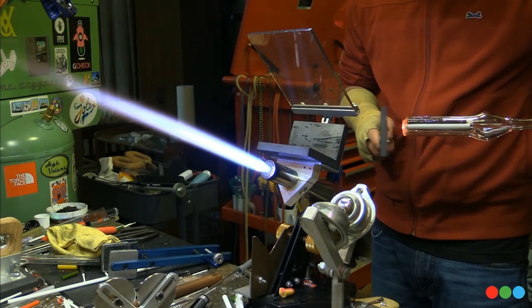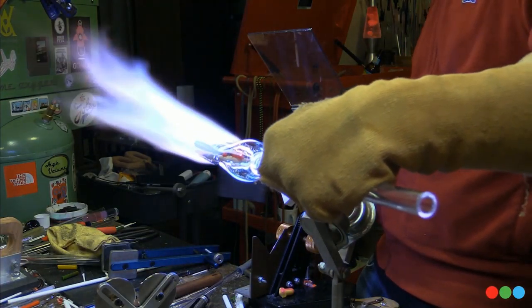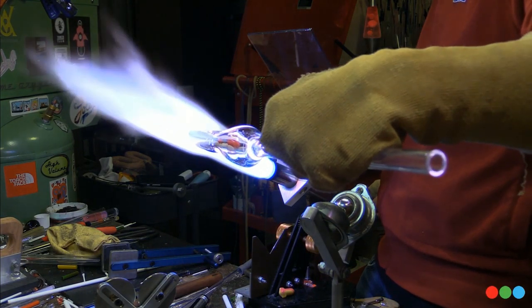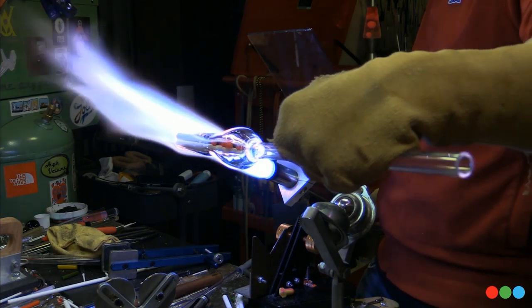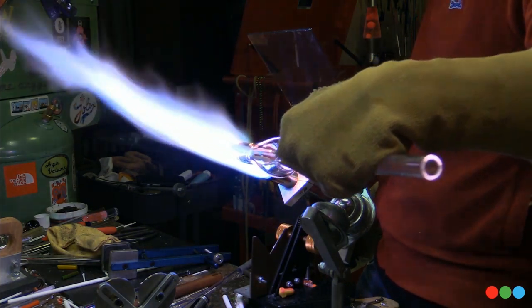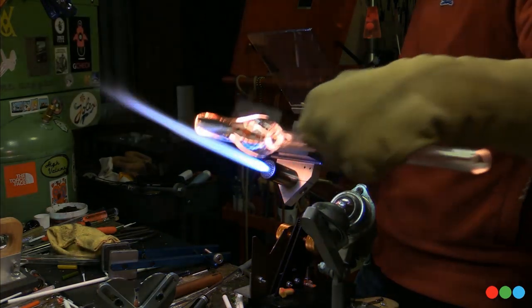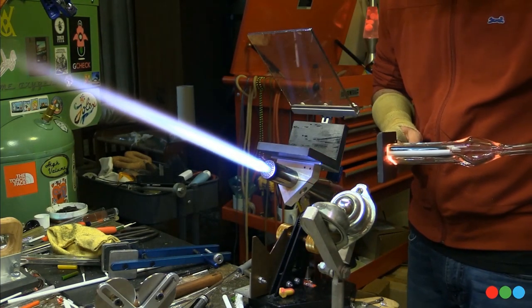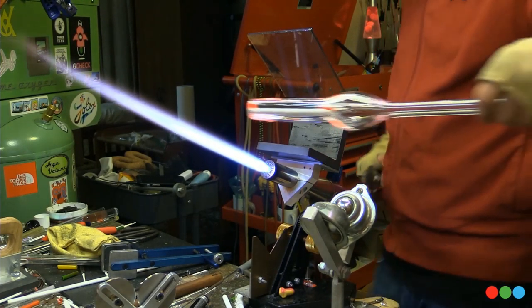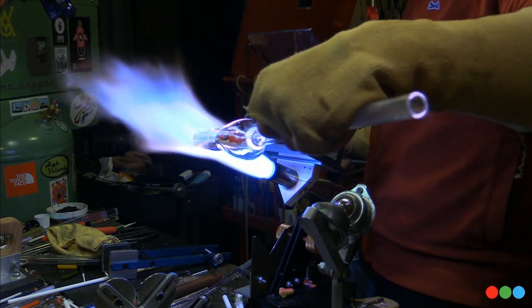So we loaded all the rods in. It's just like a vac stack: you lay the ones in on the bottom and then lay in the top. It's just doing it flat though, so lay in your one color on the bottom. And now here I tack those edges down, and then I'm going to grab a clear rod, almost like doing a little coil pot on the end. That's just to help me preserve as much of this color as possible.